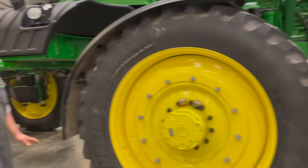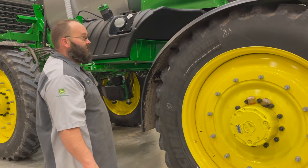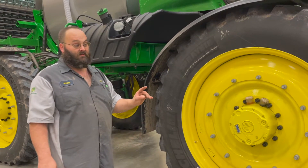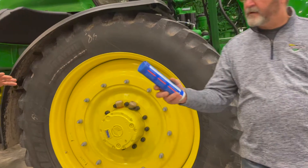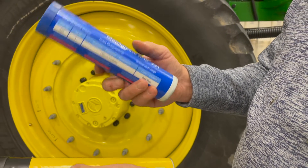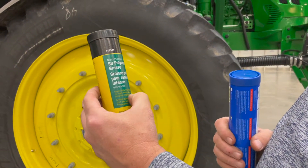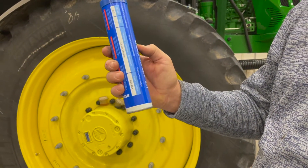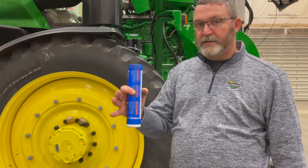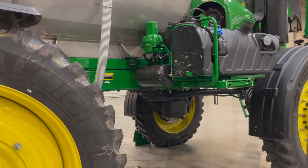Another daily service on this machine would be greasing the suspension on your struts and the boom grease points — we'll show them here in a little bit. Machines equipped with the Lincoln Luber have an Auto Luber that will do everything on this machine but the drive shaft. We recommend running Mobil GL1 grade grease. It is a little thinner viscosity than the TY6341 grease that we normally use.